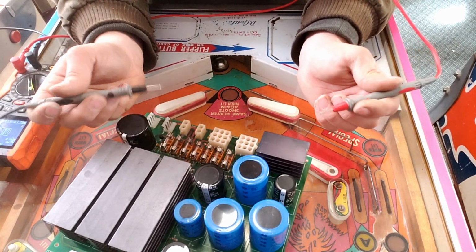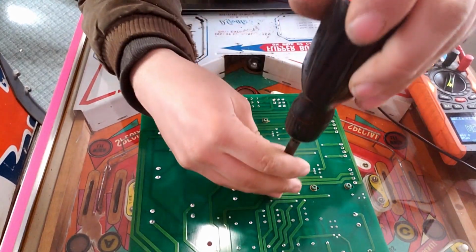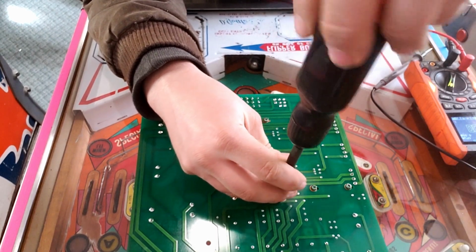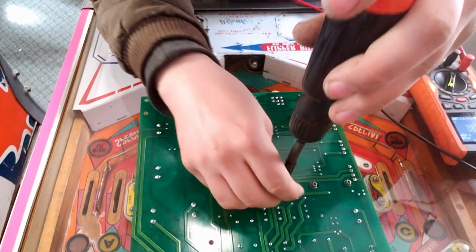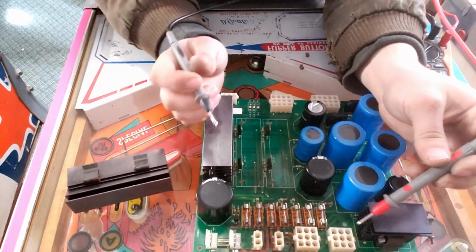Causing our no lighting. Unfortunately, those vias go into where the transistors are, which is kind of hidden by a giant heatsink. So let's see if we can remove some of these heat sinks and get to these transistors, see if we have a blown up transistor or something like that. Maybe it's a MOSFET. That'll tell us. Over the heat sinks, we can have a closer look here.